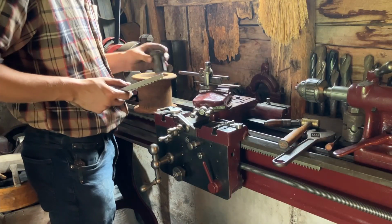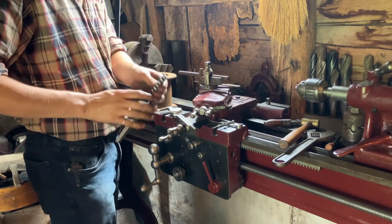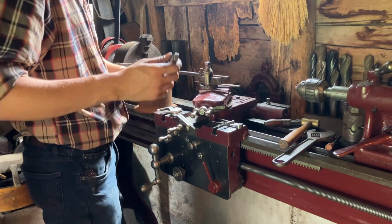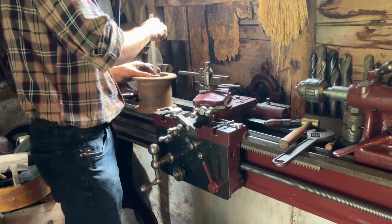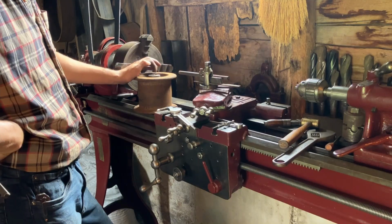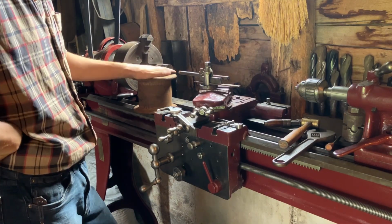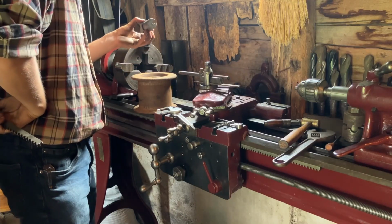I have the 1.5 inch insert and the 3/8 broach. You can see this one's broken, not the end of the world. It just means we need to use more shims. So I'll go ahead and get this pressed through and get a new wider keyway cut in this shaft, cut in the hole, I mean. There's the clock.